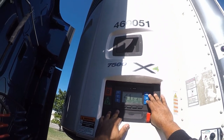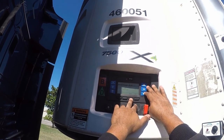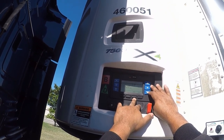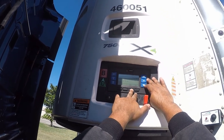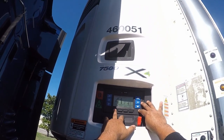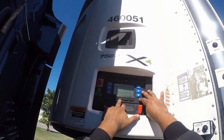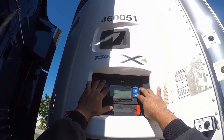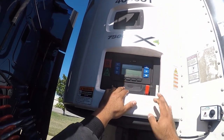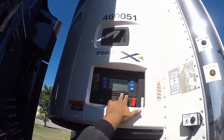So we go back to the menu, and this will tell you the hours that it has ran on the engine. It's not something you want to be too familiar with unless you are the owner of the trailer yourself, for PM purposes. To start a pre-trip, on the very bottom after hitting the menu button it'll say 'pre-trip' — you click on it, and then it'll have two options: start pre-trip, and view results of last pre-trip. To start the pre-trip you just hit equal to select it — the equal button is the select button.